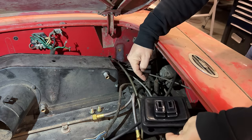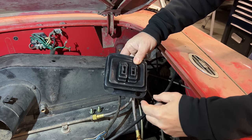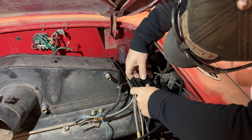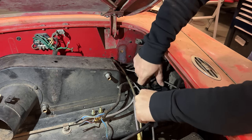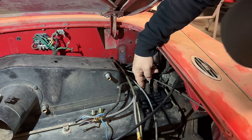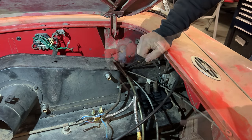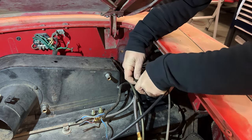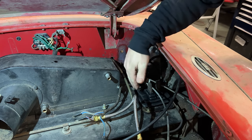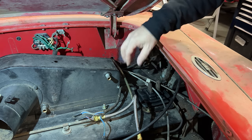I need to get these two things to come through the two holes on the excluder, and it should be as simple as just sliding it over the top. It looks like this one is pretty pliable — I didn't have any problem slipping it over there. Next we slipped on the bracket that holds the excluder down, and then these two front bolts can be put in place to hold the bracket and allow us to install the rest of the items without this moving around on us.